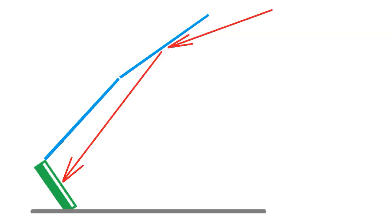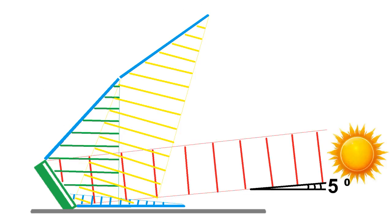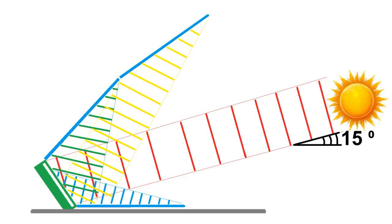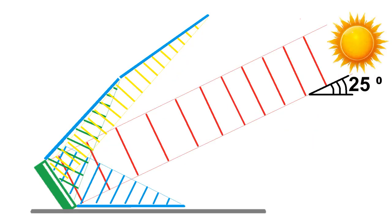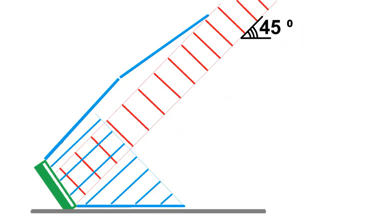These mirrors are installed at the beginning of November, and a few weeks later at the end of November we add more mirrors whose additional solar radiation increases heat production even more. Lower mirrors are installed at the beginning of December for further increases. The angles and widths of the mirrors are optimized for the low Baltic horizon angle of 15 to 25 degrees, corresponding to midday in December and January in Milwaukee. Efficiency will be lower in November and March, and the mirrors will be almost inoperative in the remaining months.